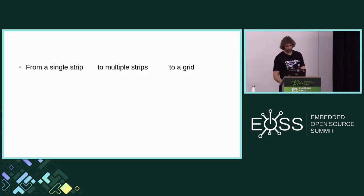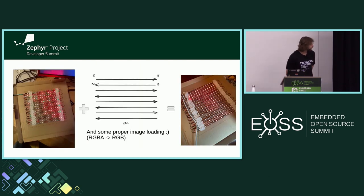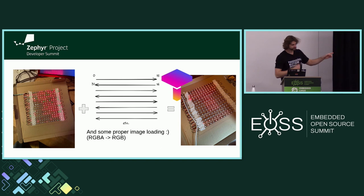Step one: validation. It's basically assembling the cardboard, having a LED strip, cutting it, soldering it — and all should be fine, right? Well, it turns out on the right you have what should be displayed, and on the left is what was actually displayed. I cut the strip in a snake manner and read the data line by line, so I had to reverse it. Also, I loaded RGBA images and tried to fit them into an RGB buffer — obviously total garbage. I fixed that and it suddenly started working.